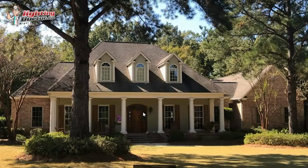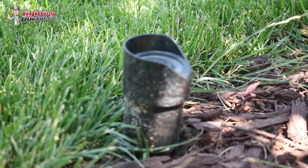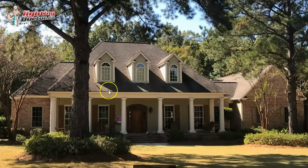Typically what I'll do in a scenario like this is wherever there's a downspout, I'll run my wire directly inside or behind it. Then I just run it across the gutter and mount my 3 uplights. Again, I would just use a standard uplight. It's a perfect light for that. I like the black finish in that too, because it kind of blends in with the roof. Not that anybody really notices it. You're the only one who will notice it. It's there. But you have 3 of those.